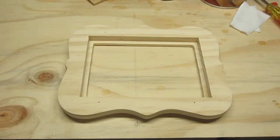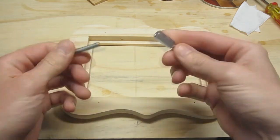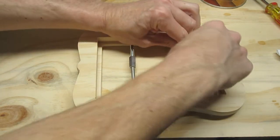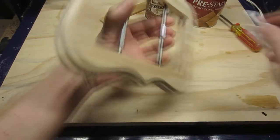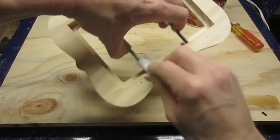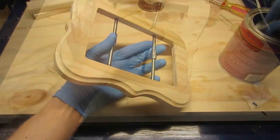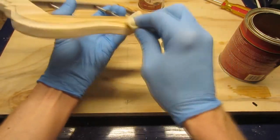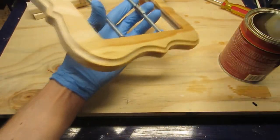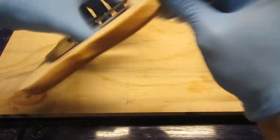To hold the frame during the finishing process, I've made mini expander bars out of threaded rod and coupling nuts. These can be placed in the main opening on the backside of the frame and tensioned up, allowing finish to be applied to all major surfaces at once. They will leave a small mark, but since this area won't normally be seen, I'm not concerned. I'm going to start by applying two generous coats of pre-stain, allowing each coat to soak in for 15 to 20 minutes. Directions suggest wiping off any excess after the final coat, but the radiata pine has always absorbed it completely.